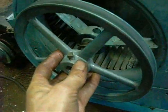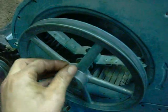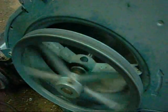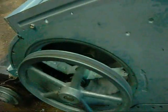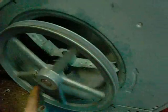It's a nice little blower. The bearing is nicely preloaded — no lateral play in the shaft, but it still spins nice and free. The pulley is a pretty good fit, not too tight like half of them are. The old Canadian quality — considering this thing went from 1968 until probably a month or so ago without failing, it's pretty good. Lifetime sealed bronze bearings, and I don't believe this thing has ever received oiling or anything.